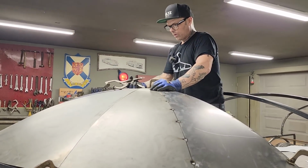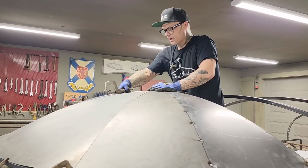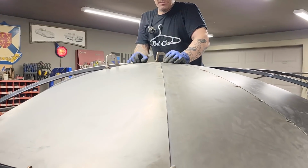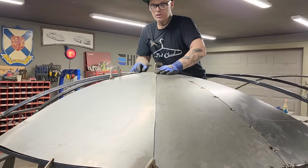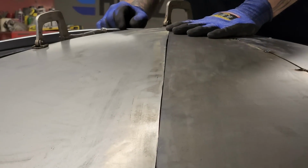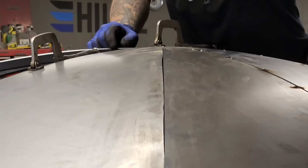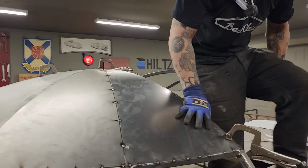Beautiful. The whole center of this is going to have to be zip cut because I'm over too far. But I'm going to take the zip cut. It's looking good, like it's fitting really good there. But what I'm going to do is run the zip cut down there and get us a gap in between it so we have penetration to the square stock. Lay up off there quite a ways. Now, if you'll pass me the zip cuts here.